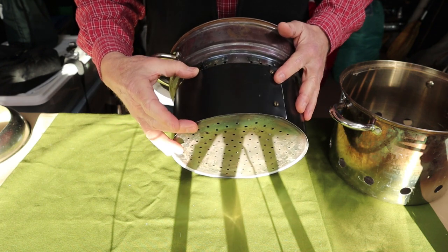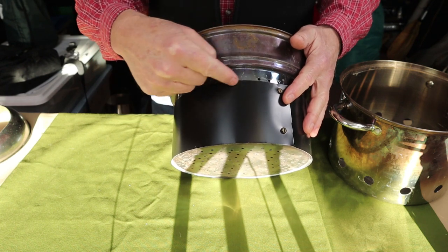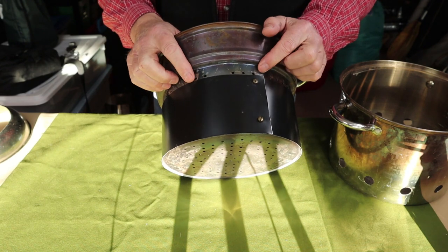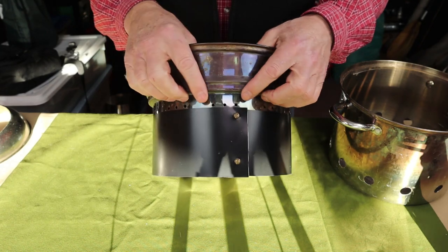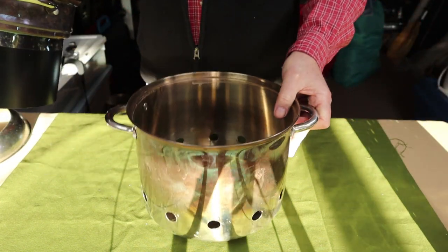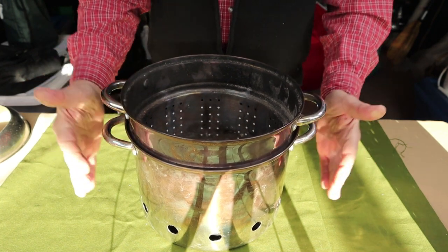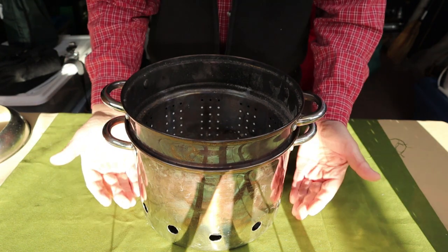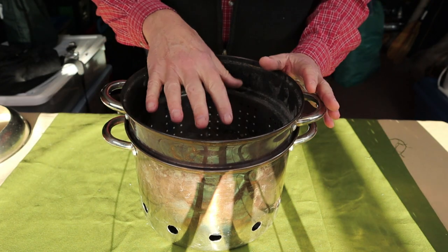I left the flashing at approximately four and a half inches high with just one set of air holes. I can easily remove more metal if needed. So intake air comes through all the holes on the bottom, and secondary jets are the holes around the outside at the top. This fits inside the stock pot, which has its original holes, creating a gap between inner and outer pot where air travels up and enters through the bottom holes of the strainer.